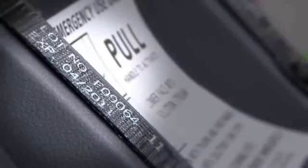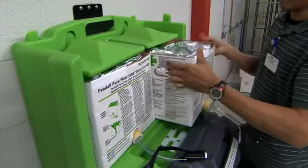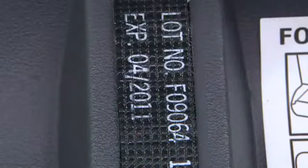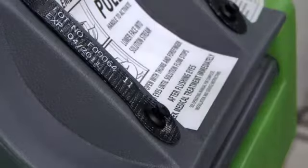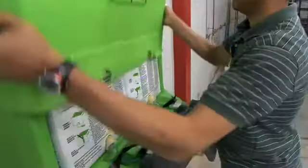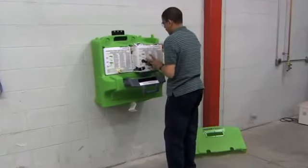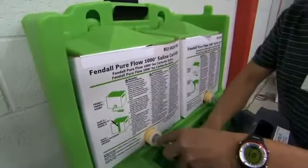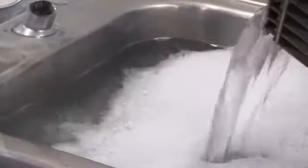The cartridge fluid expiration date is printed on each black strap and on the front face of each cartridge. Cartridges must be replaced on or before the expiration date; they expire at the beginning of the month stated. Remove the activating straps by unscrewing the center pin of the fastener and pulling the fastener body out of the door. Remove the station cover and follow the directions as detailed in the installation section. Full cartridges weigh 33 pounds, or 15 kilograms, each. Make sure to dispose of the cartridges properly; they may be drained and disposed of as regular waste.